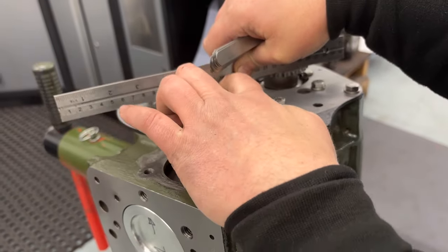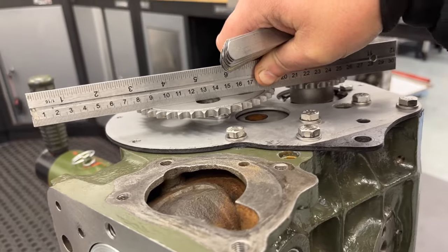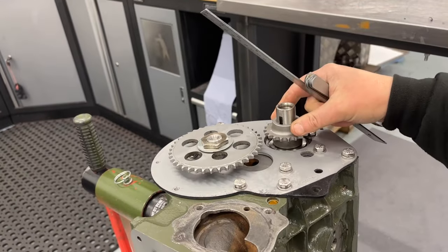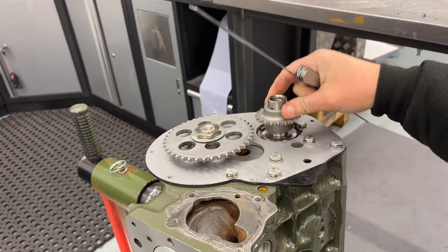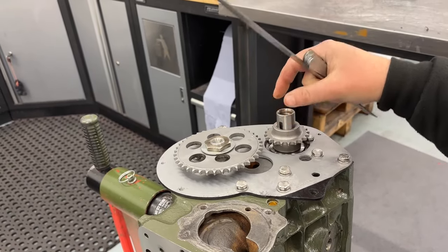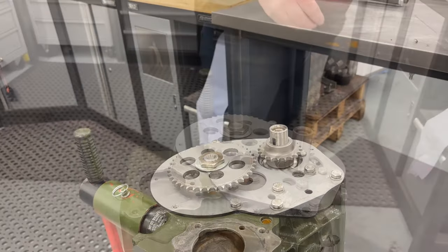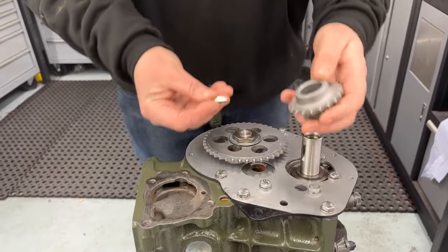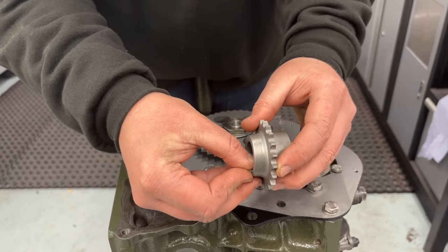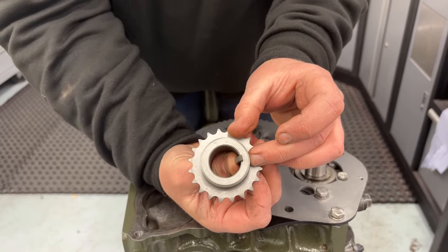After adding the shims, there is no light showing underneath any of the gears — those gears are now perfectly in line. We move on to fitting the Woodruff key. Take the new Woodruff key, make sure it fits in the gear — a nice sliding fit, fully located. Leaving the newly installed shims in place, offer the Woodruff key centrally to the slot, just start it, then use a soft brass punch to tap it home.